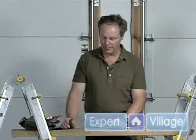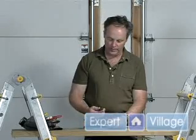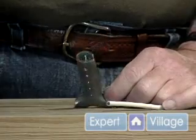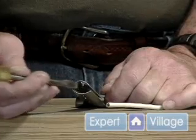We're going to use a couple of basic tools to help strip some Romex wire if you're doing any wiring. First thing we have to do is get the sheathing off the outside of it, and to do that we have this stripper. There's a wire gauge meter on the stripper if you need to know what size wire you have, and inside there's a little razor that's used to cut through that wire.